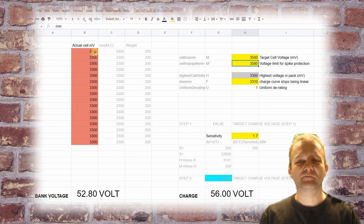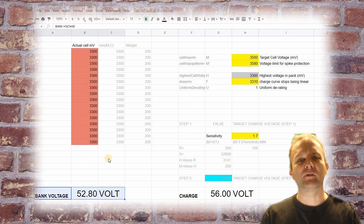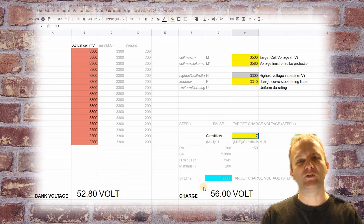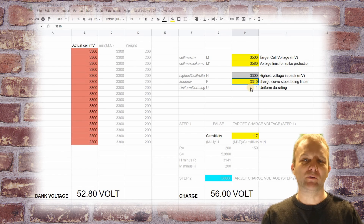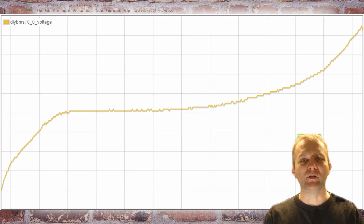On the left we have all the cell voltages of a typical 16S LFP battery. In this example all cells are perfectly in balance, all exactly the same voltage. On the right we have the same parameters as we see in the DIY BMS configuration page. The target cell voltage is the maximum you wish each cell to charge to. The spike protection is the maximum voltage a cell could handle if needed without damage. This value helps the software stop the voltage jumping all over the place as the charge process continues. The other parameter indicates at what voltage the cells stop having a linear charge voltage — for LFP this is around 3.31 or 3.32 volts. This is often referred to as the knee voltage when you look at a charge graph.